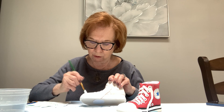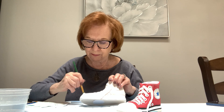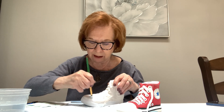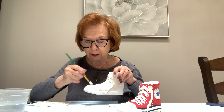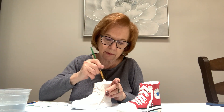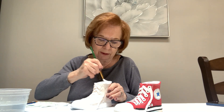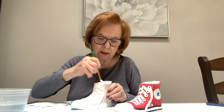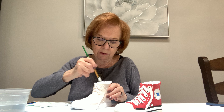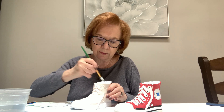Put your paints on very smoothly. I repeat this in all my videos, but not all of you watch every video: put them on nice and smooth. If the paint stays very wet-looking for a long time, you have it on too heavy, and if you don't smooth it out the ridges will stay and you can't get rid of them without sanding the piece down. Pull it out and look — where I put the white, it's already dry. You might need two coats of white; if you see yellow through it, just do a second coat. Two coats is a good idea with the white.